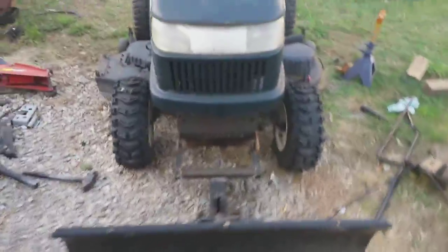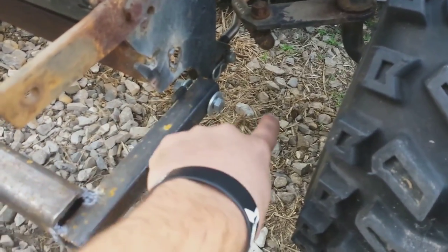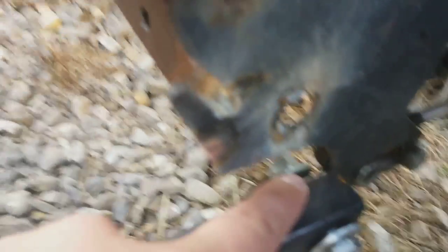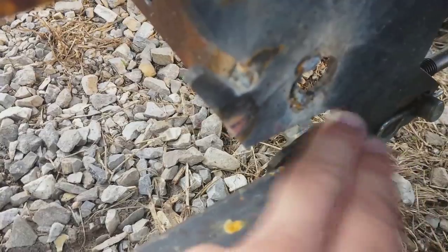All right guys, now we got a little bit of light out here. Let me show you what I've got done already. I've made my mounting supports — I drilled a 3/8 hole through here and I'll put a 3/8 bolt through there. I can tighten this down, but I think I'm gonna make a steel rod go all the way through and close up this gap. That way whenever I put this up on here I can just run my rod all the way across and it won't bounce out. I've welded that piece on there — as you can see, that weld will hold, it's plenty strong enough.